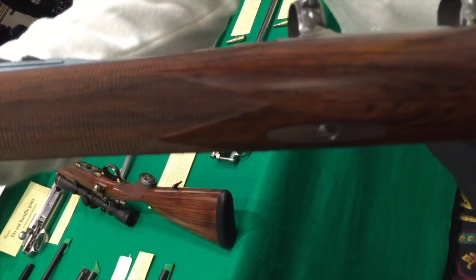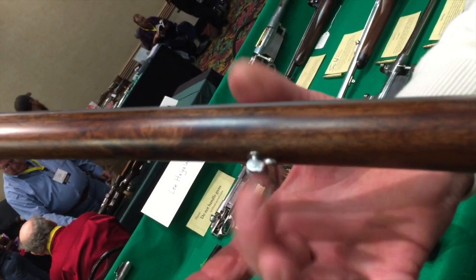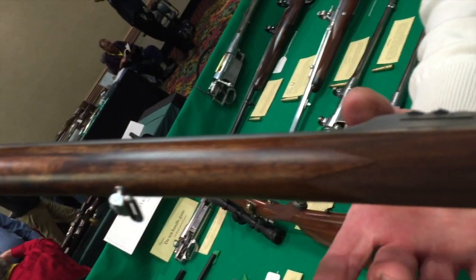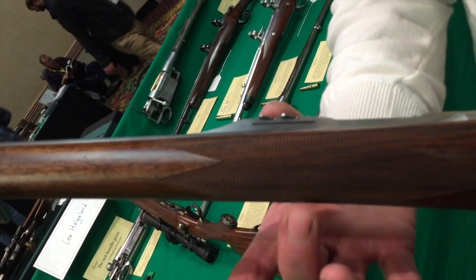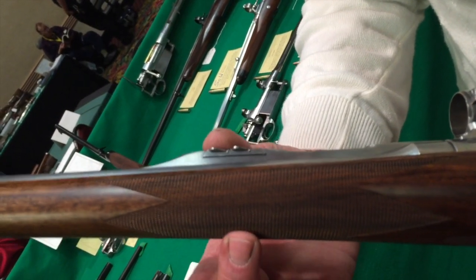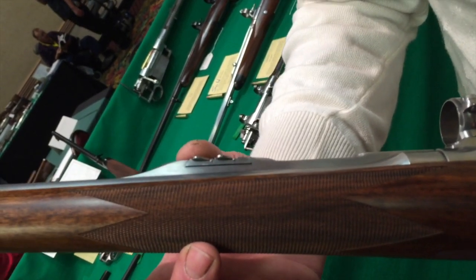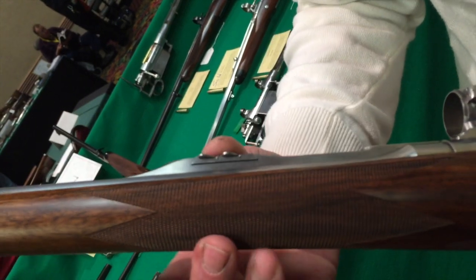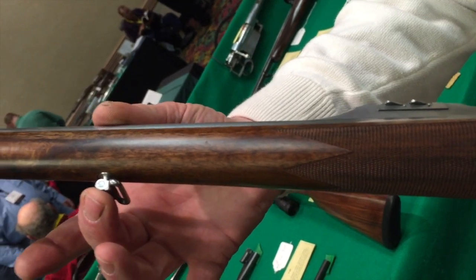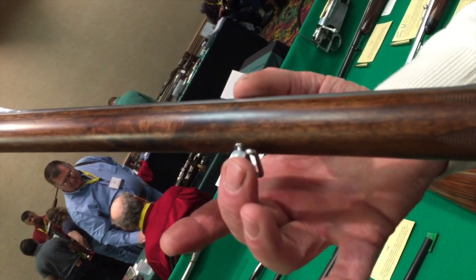There is contact up here, and anytime you have contact up here, or let's call it pressure up here, where this is screwed into the barrel, you're going to have pressure there. Likewise, on the old Winchester Model 70s that used a barrel tie down, people always removed that screw and threw it away. That's because it was machine inletted and they didn't have perfect contact. When you do this either with a full length stock like this or a barrel tie down like one of the others here, you absolutely have to bed that.